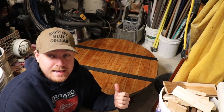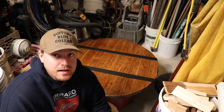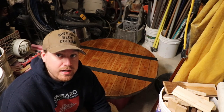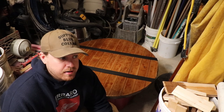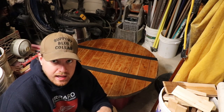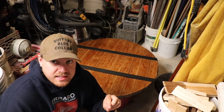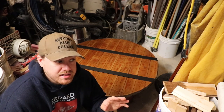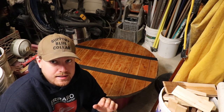So now that the steel is installed, I'm going to get some clamps, clamp this down and let it sit for a few hours. It is the PL Fast Dry, so I believe it has a dry time of only an hour — working time I think is only 20 minutes, so I've got to get something on this real quick. I'm going to let it sit probably for the rest of the day, and then this evening I'm going to hit it with its first coat of the Armor Seal. The reason I want to do the Armor Seal after is because I equally want to protect the steel as I do the wood. Underneath the steel it does have two coats of the Minwax, and then the steel itself is coated and sealed in there with the PL. When I seal it with the Armor Seal over top of everything, all the little cracks between the steel and the wood will get filled — you can use this stuff to fill up to almost a quarter inch gap — and it'll dry really hard, so no water is going to be able to sneak in and start to slowly rot this out over time.